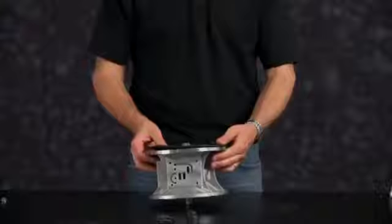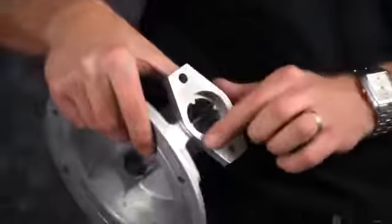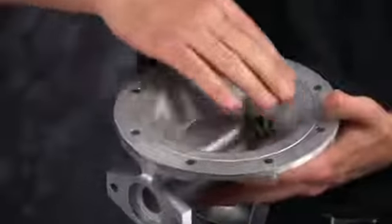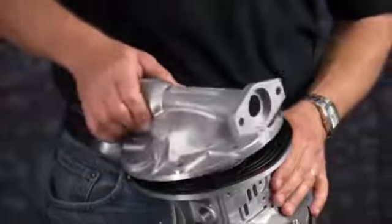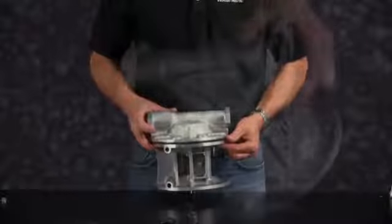Inspect the outer chamber for casting integrity. Inspect the machine surfaces and radius of the chamber for damage or material buildup. Scarring, scratching, or material buildup can be cleaned up using emery paper, crocus cloth, or fine sandpaper. Chamber orientation requires the discharge side of the chamber to be installed in the same direction as the air valve face on the center block.